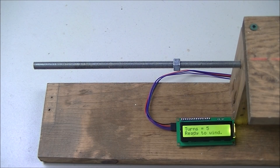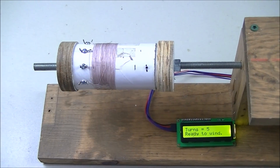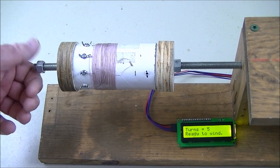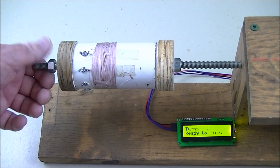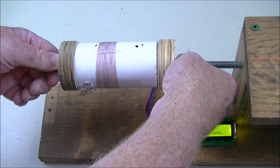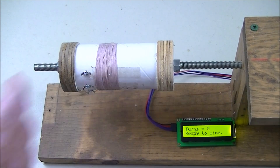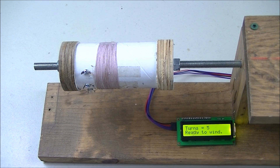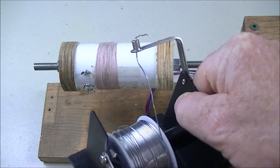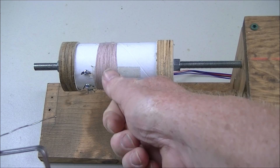Here's the rod end connected to the stepper motor. You simply put this over it, put a nut on it, and tighten it down until it's snug. As far as a wire guide goes, I kept it simple — I use something like a solder holder to keep the wire, and I guide it on by hand.